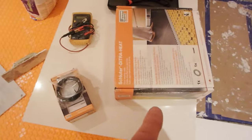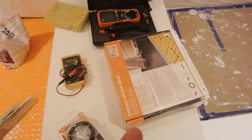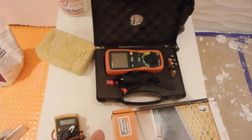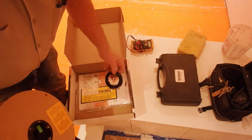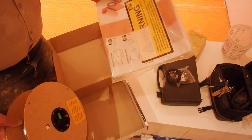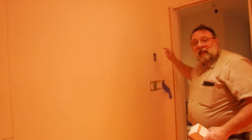In the wire box you also get the wire and an additional sensor wire, so you install both and have a backup. Since the thermostat is going over here, you only connect one of the sensor wires; the other is a backup. You only need a multimeter, but if you have a mega ohm meter that will give you five years of extra warranty. So we have two sensor wires.